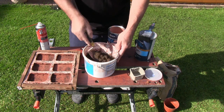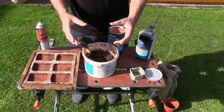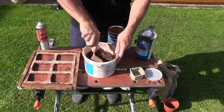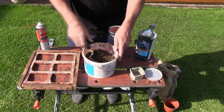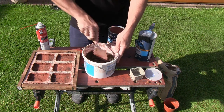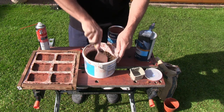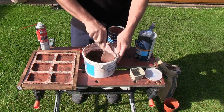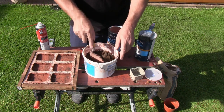As long as you don't go below two portions of red dye — if you go less than that, the brick tile will start to become grey and it doesn't look very realistic. So two is the minimum; then maybe another batch do three, and just vary it so that you get a good variation around the actual pizza oven dome once these are cured and you're putting them on. That gives it a more realistic effect.